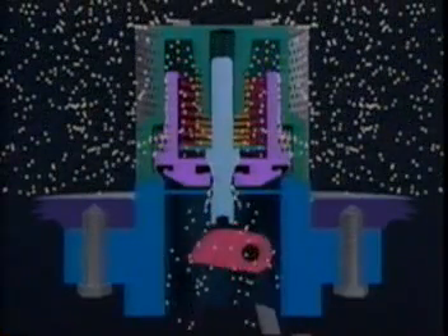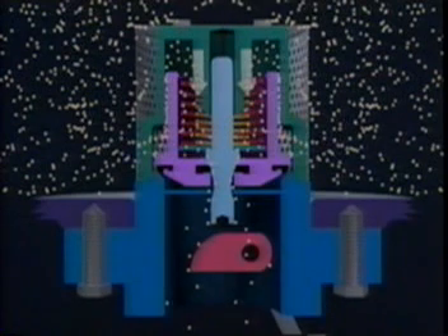To close an opened valve, rotate the cam away from the main poppet. The force from the closing spring pushes the poppet to the fully closed position. The seats create a gas-tight seal with the body and the stem to stop the flow of gas.